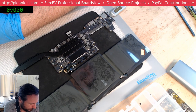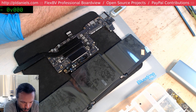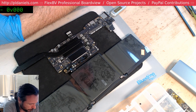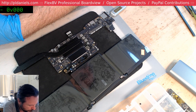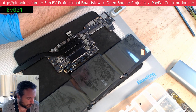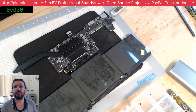Yeah, in this case, it was definitely a fault of my own assumptions here, because I was assuming that these would be shipped in at least some degree of a storage voltage. As long as they're over 3 volt a cell, then the charge rate should be pretty much full. For it to be forced into trickle mode, it generally has to drop below 2.9 before it'll activate trickle charge. So it's a bit of a concern.